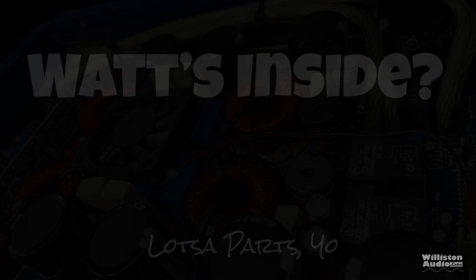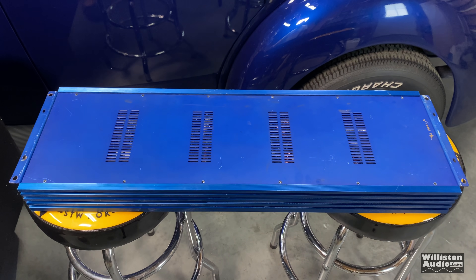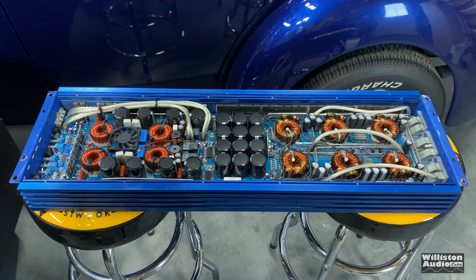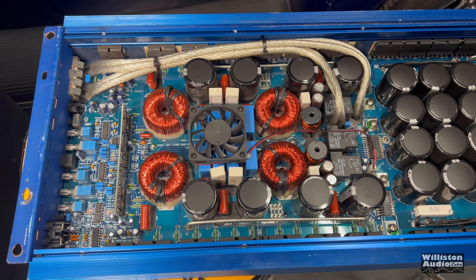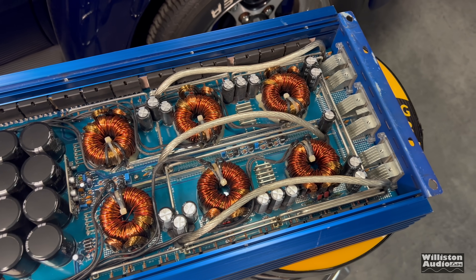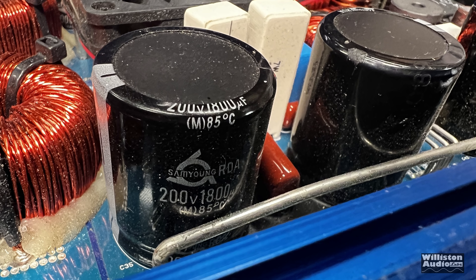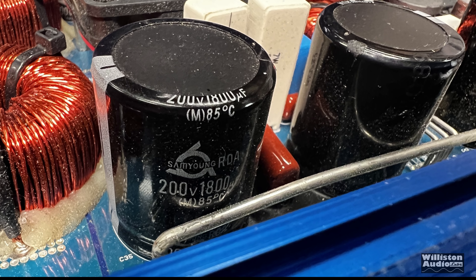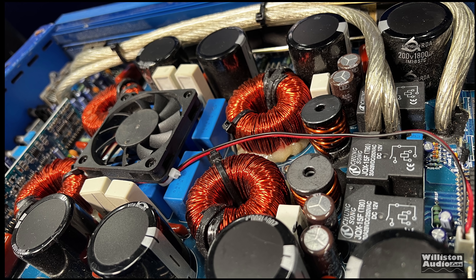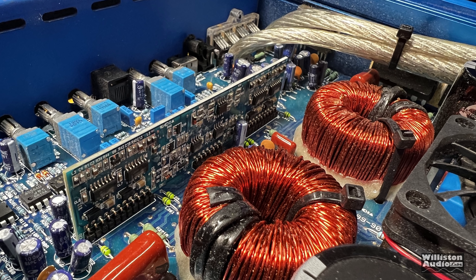If you stick around to the very end we'll run the amp at 0.8 ohms. Let's figure out what's inside — lots of parts! Taking off the screws on the bottom and prying off the bottom panel: the panel is beefy, as is the amplifier itself. You can see the chokes for the output, plenty of reserve capacitance, and six toroidal transformers for the power supply. The rails run on 200-volt 1,800-microfarad capacitors — these are 85-degrees Celsius; I'd like to see 105 honestly. And yes, this is a typical Korean design used over and over on many different amps. This one unfortunately is not quite as efficient as I've seen with some others.